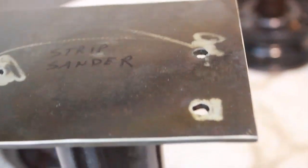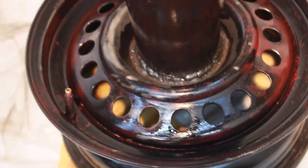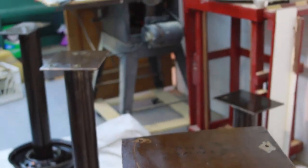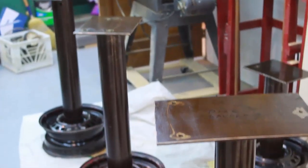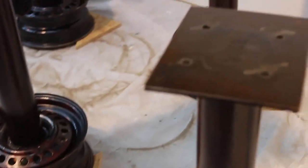And like I mentioned before, if you're going to be coating a car hood or something like that, you're going to want to wipe whatever rag or brush you're using, because you're going to be covered in rust, because all the rust that I didn't get off of here was picked up on the brush and in the liquid. So unless you want to be sloshing all that rust and dirty Penetrol around, you better empty out your cup and clean off your brush.